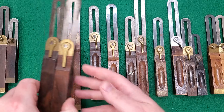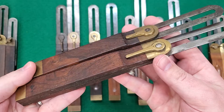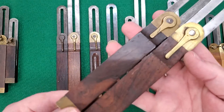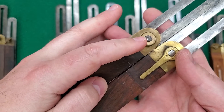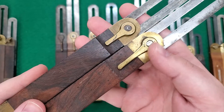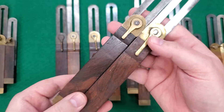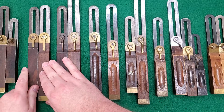Type two runs from 1876 to 1878 — a very short time. This is the introduction of the lever that is so common to the Stanley bevel. We have two variations: a pre-patent and a post-patent. The pre-patent has no patent on the lever eye; instead it says 'patent applied for' on the body. The other variation has the patent date of September 4th, 1877, going around the eye of the lever.